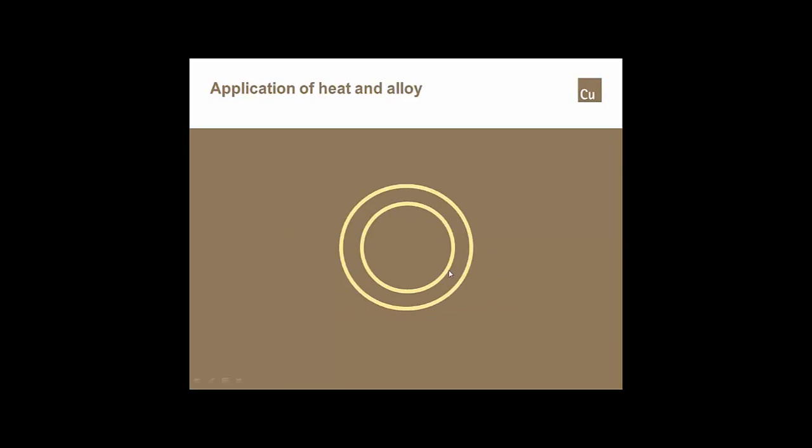Now, if we were to look at this process, and you have to bear with me, using PowerPoint, I can't make it nice and smooth, but if I was already completed preheating the tube, preheated the fitting, I'm getting ready to make the solder joint. If I start at this point with my torch, I would want to start adding alloy somewhere in this area. And I want to follow my torch the whole way up this joint till I get just about to the 12 o'clock position.